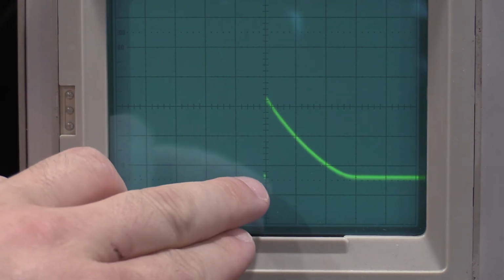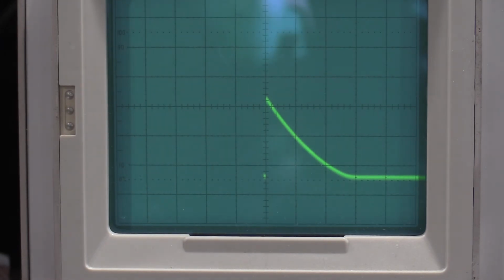This is the correct delayed sweep starting point, so just starting there, time marker, and that is exactly on 1.0. They want us to check 9 again. There we go. And the stop needs to be adjusted just a little bit. So 572. A very touchy control, so that's about perfect for there, and it interacts with 1.0.